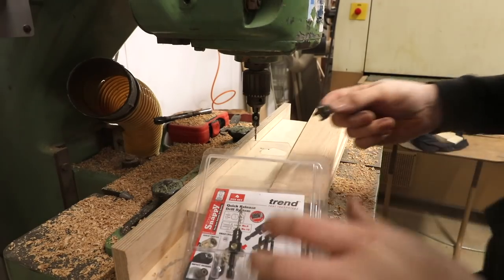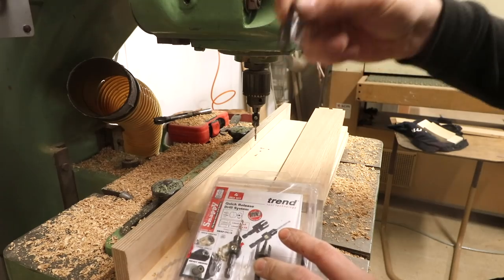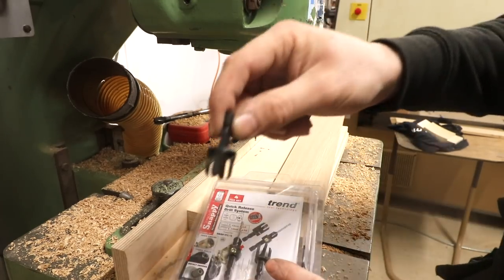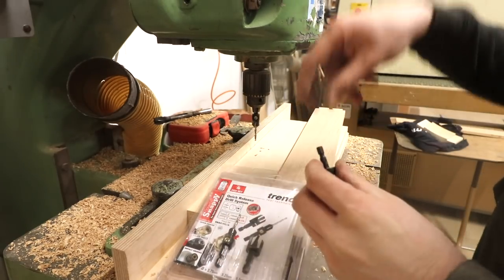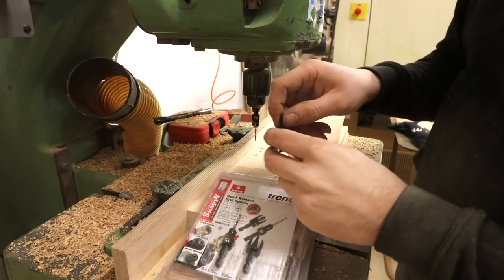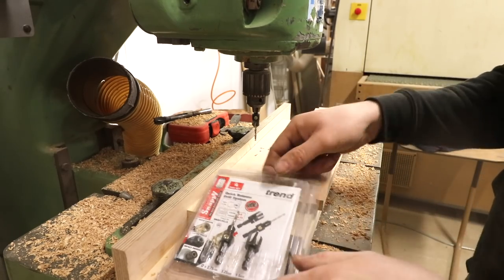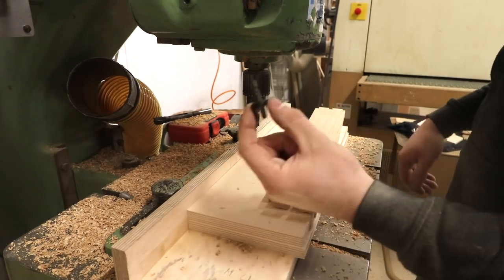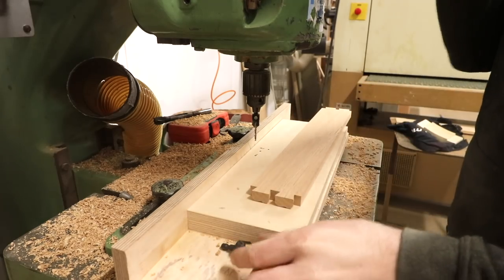Okay, I'll show you how I do the plugs now, or make the plugs. These cutters are worth their weight in gold, so I'll put a link in the description, but they produce a perfectly tapered plug with a little rounded end that makes it really easy to get into the plug hole once it's been drilled. A lot of the plug cutters just produce a perfectly straight plug, and you find them really difficult to tap into the hole without damaging the outer edge of the hole. So it's, like I say, worth the weight in gold, and by the time you've bought a pack of 100 plugs, you can pretty much buy the cutter and make the plugs you need out of it. It'll last a lot longer than 100 plugs, so good value in my opinion.